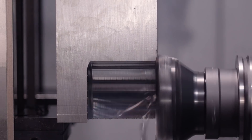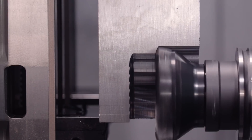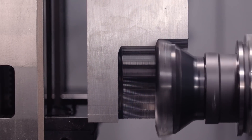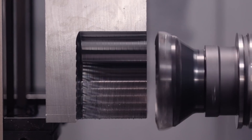If you're anything like me, you love seeing massive chips flying at super fast feed rates. I've always been a huge fan of high performance milling with super deep depths of cut, lower radial engagement, and machine-maxing feed rates. Tools like high feed mills always seem a bit boring to me, but the fact is that sometimes low depth of cut and high radial is the way to go.